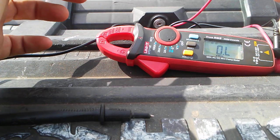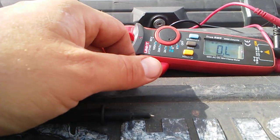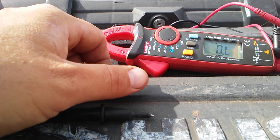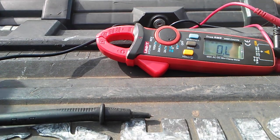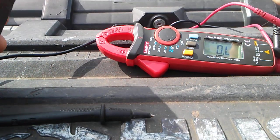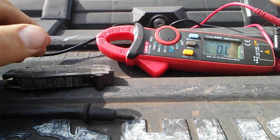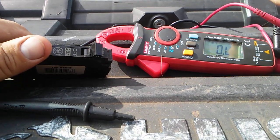This was a brand new breaker panel when it was installed — all brand new breakers. There's no buzzing or humming in the panel that I can hear. The only thing I can figure is this is just heating and contracting over time with use. They're 20-amp breakers on 12/2 Romex, so it's all adequately sized to handle the load.